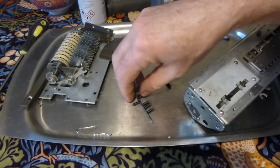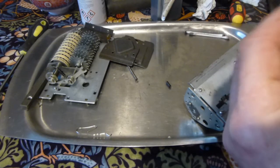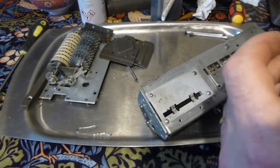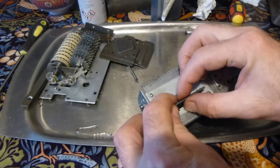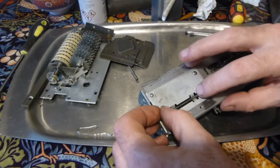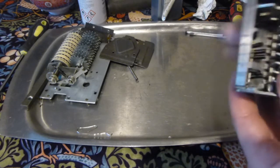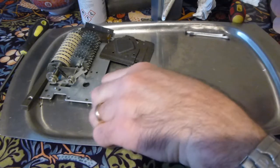Turn the carriage upside down. There are 8 springs, and there are 3 gaps in the carriage, and arrange them so that you're dropping four of the springs down the big hole in the middle, two of the springs down at the one at the end, and just hold the shaft in position with your finger. So there's all the springs.